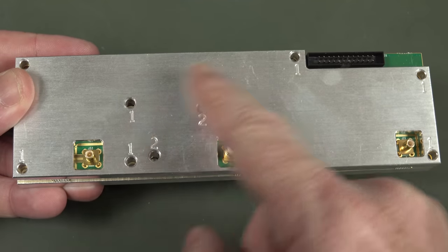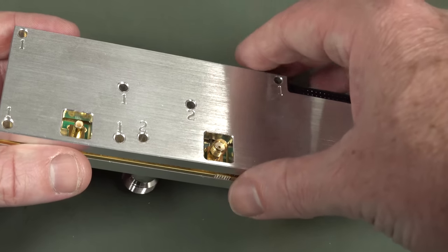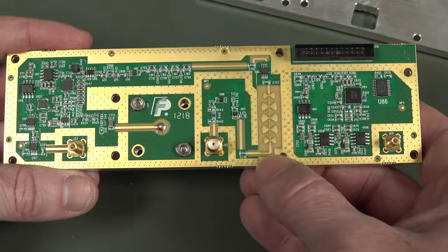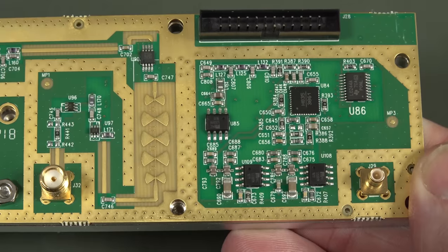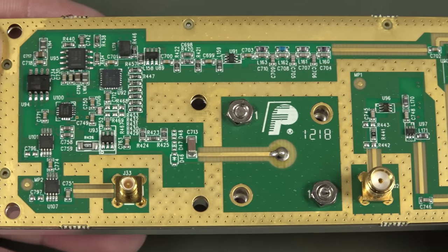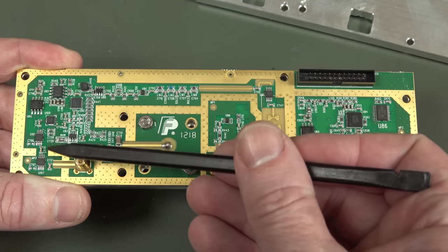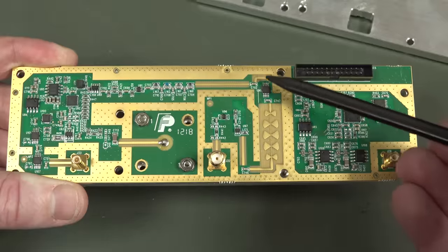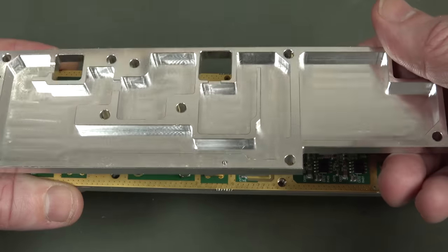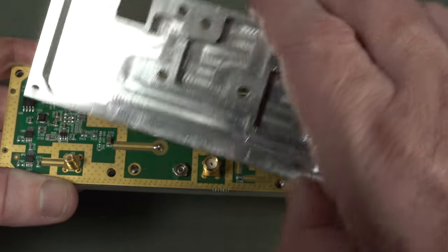I like how they've numbered the screws here. Beautiful gold plating - look at that. And we've got our distributed element filter, a nice little bow tie arrangement. To make heads or tails of this, we're going to have to compare it to the previous model to see what they've added. It's got your classic block-based approach - signals pass between the individual blocks, all shielded with solder mask removed and gold plated. They machine out little slots so the signals go between the individual blocks - that's how you shield one section from another.